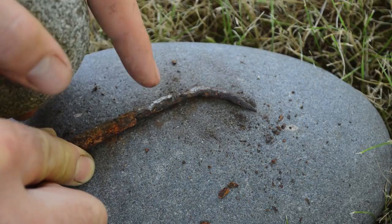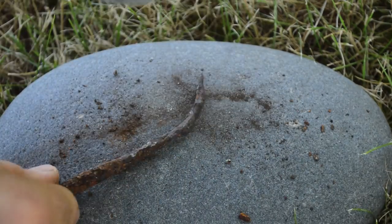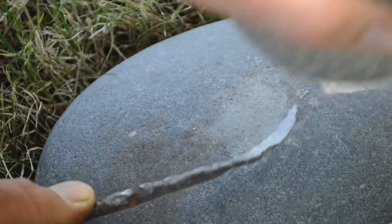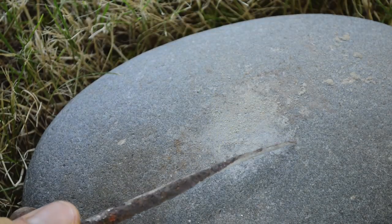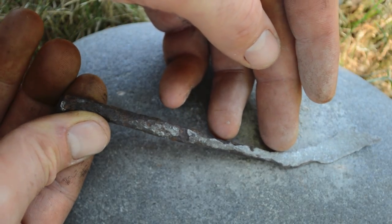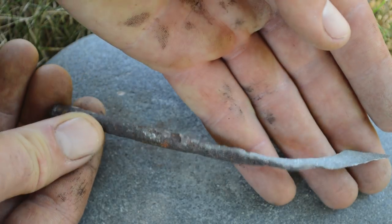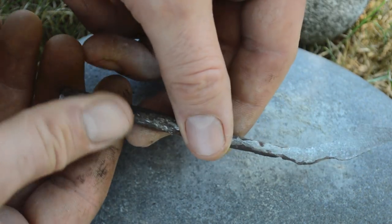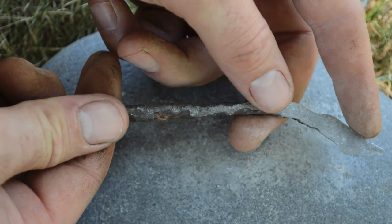That outer layer is just rust but I'm starting to see some shiny metal as I hit it harder. I've been working this old rusty nail for about 10 minutes just pounding it between two rocks and on the tip the rust has flaked off — you can see shiny metal and it's actually made a really nice blade. The next step is to work it on the stone to get a nice sharp blade, then break it off and move on.